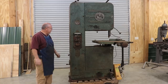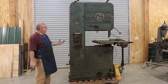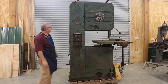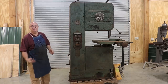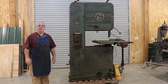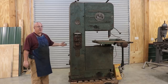The paint job's all crinkled off of it, but when I really started looking at it and checking things out, I think this machine's going to clean up really nice. What it is: this is a vertical 26-inch bandsaw made by DoAll. I was able to look at the serial number right here. The serial number is 2640118. The 26 at the beginning is for the 26-inch model, the 40 stands for 1940 — which is when this saw was built — and 118 is the 118th saw they made that year. So this is a pre-World War II DoAll bandsaw.